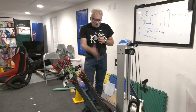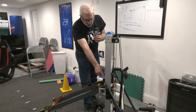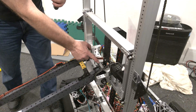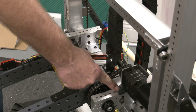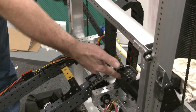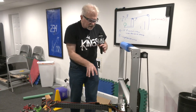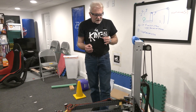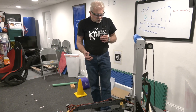Steve, go ahead and run her up and down, run the arm back and forth a little bit. They're all independently controlled. You'll notice this is our drive mechanism — it's a fairly conventional elbow or shoulder joint as people might refer to it. We've got a tensioner here that helps us set final tension — the nautilus-shaped cam lets us set the appropriate tension. Chains are a challenge. Several of our dimensions were already set and we had to accommodate that with the chain, making a few modifications because chain has very specific lengths.